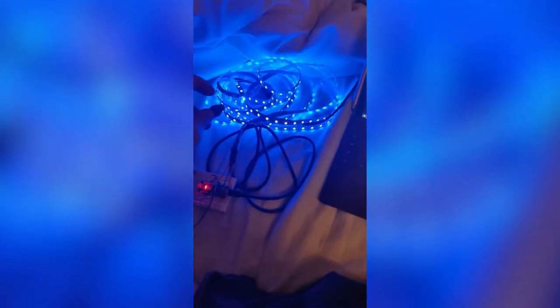And then the real question from there is, can we illuminate these lights from a light in engine? I don't have a video of this, but my main objective was to turn all the lights on in the strip to one color of a light source. So we'll take the light, get the intensity value, the red, the green, the blue, output that to the Arduino as a print string, and then read the Arduino and assign that to the lights, right? We'll make the lights turn that color, turn on, turn off, whatever we need to do off the light. And that was quite easy to set up, right?